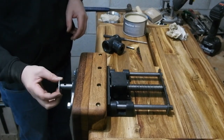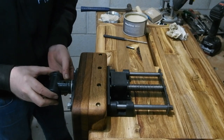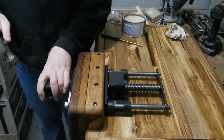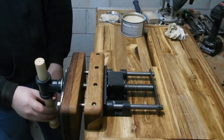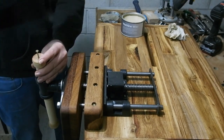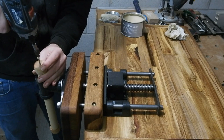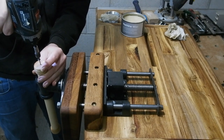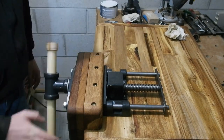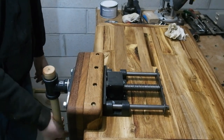On the moving jaw I use a couple of 40 by 4 mil screws with washers — these will be replaced by 6 by 40 mil coach screws when they arrive. You just saw me put a large washer on the outside of the vice; there's one on the inside face too to arrest the thread — it is essential. A split pin fixes the winding mechanism, then finally the handle — basic pine, sold separately. One reason I went with the Axminster vice is it claimed a quarter turn for the release; in reality it's more like a half turn, but ideal nonetheless. It does need about a wind and a quarter to engage the clamp properly though — a strategic washer could halve that, so watch this space.